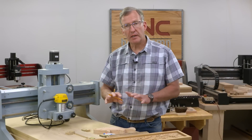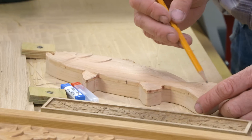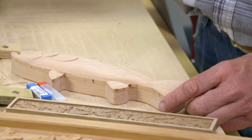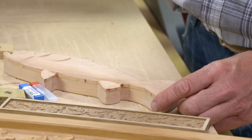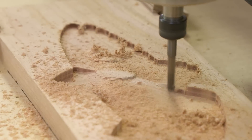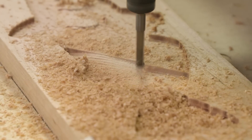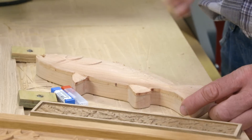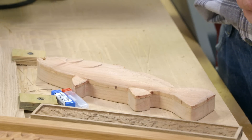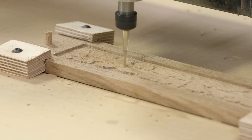When setting up your roughing and finishing cuts for carving work, you're given a choice between raster and offset cutting methods. The raster method starts at one end and goes back and forth, progressing across your carving — you have the option to set it at an angle. For roughing cuts, I like to use the raster method at 45 degrees as a very efficient way of clearing all the waste. I don't often use raster for a finishing cut because it can leave a slight fluting visible across your carving. For the finishing cut, I prefer the offset method, which tracks back and forth with the bit following the grain — less visible and a better quality cut. But it depends on the material and the wood, so experiment.